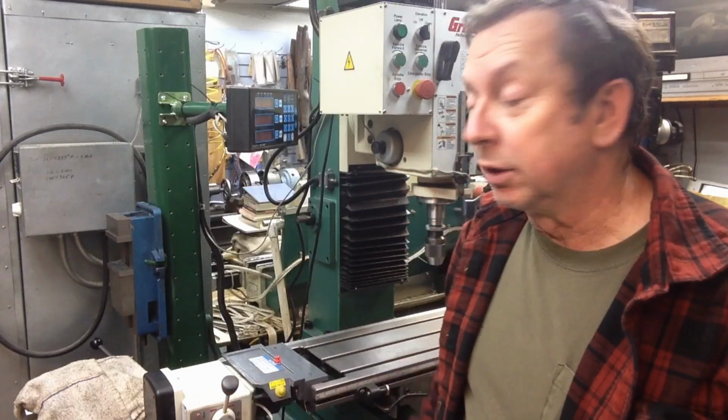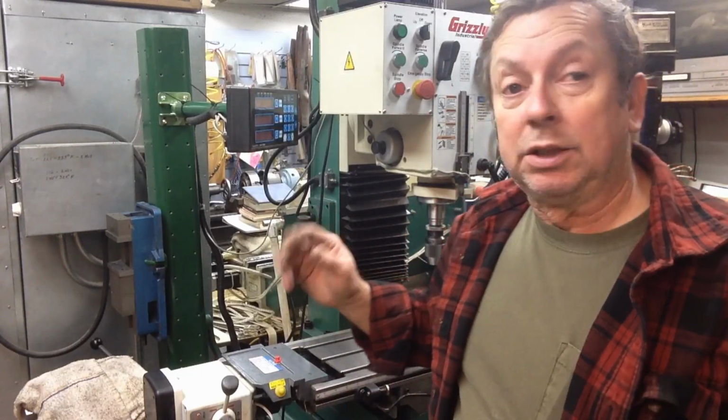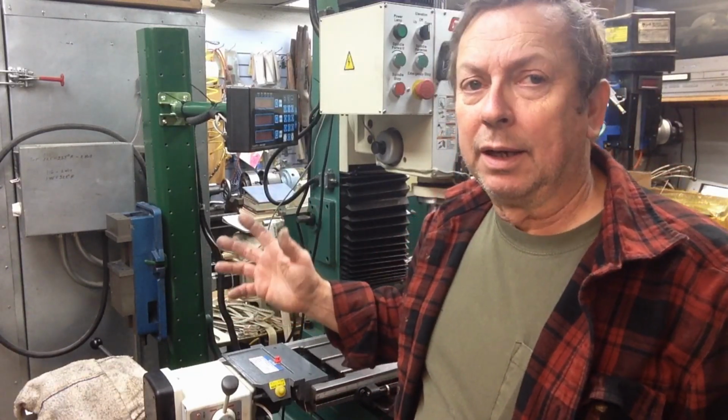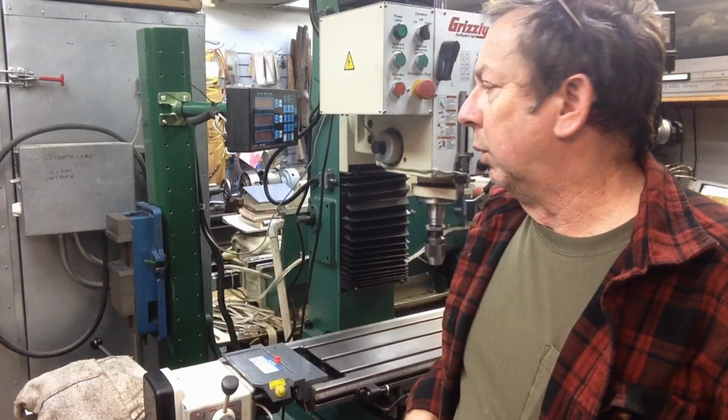Hopefully it'll give you some ideas, and it'll explain some of the issues that I had with this before that I was covering, mainly with the digital readout and the scales. That's what started everything off badly yesterday, where I'd moved it around. A couple of axes were dead on the digital readout, and it ended up being just a bad connection for one of them, and I think I've remedied that where it plugs into the back of the digital readout, which has always been a little bit of an issue, but not a real one.